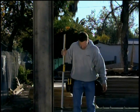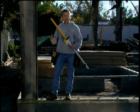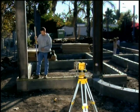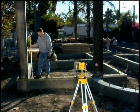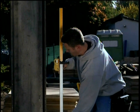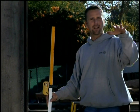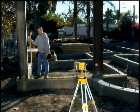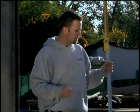I climb up on the foundation and I always bolt down my sill plate first, then walk around and check my sill plate for level. If necessary we'll put shims underneath to bring it up so the top of the sill plate is level throughout the whole foundation. I loosen the bottom clamp and extend the grade rod until I get an even tone on the receiver. An even tone means the receiver and zero on the grade rod are even with the laser.